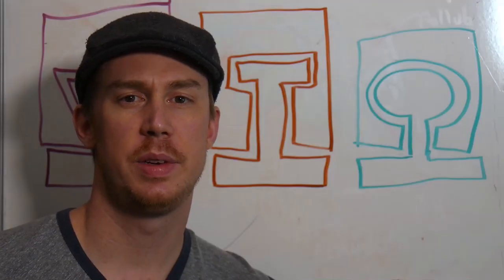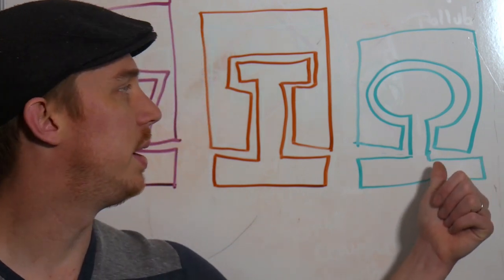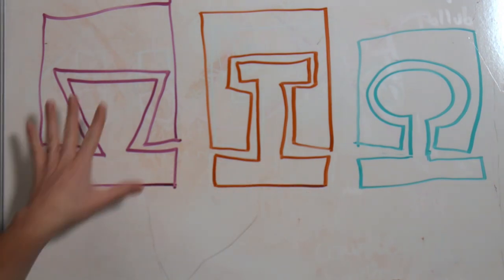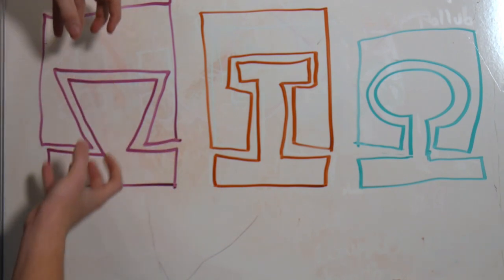So after shelving the idea for a few weeks, inspiration finally struck. I'd just make it slide together. I considered some different options for the rails that would hold the parts together. The three top contenders I called the lollipop, the T, and the V. I was most happy with the V because of the way that the forces would be spread out and encourage the parts to hold together.